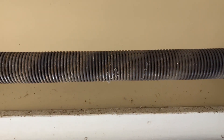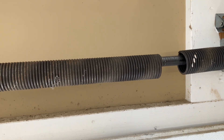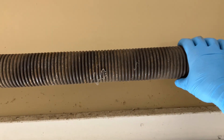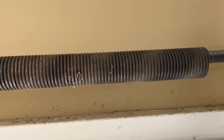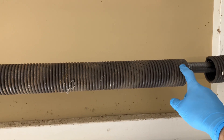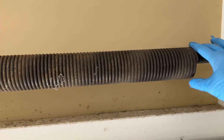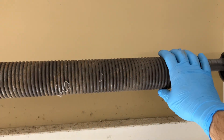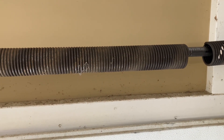I also found that I could have gone with a smaller diameter coil or even a shorter one — it would still lift the door. The big difference is how long it will last, since these are rated for a certain number of cycles based on the weight of the door. There was one website where you type in the door weight and height, and it gives you all your options along with the cycle ratings. I could have used a 207 thousandths coil, but its cycle rating was only about 11,000, whereas this one is triple or quadruple that. Do your research, or just call a garage door company to get the right tensioner spring.